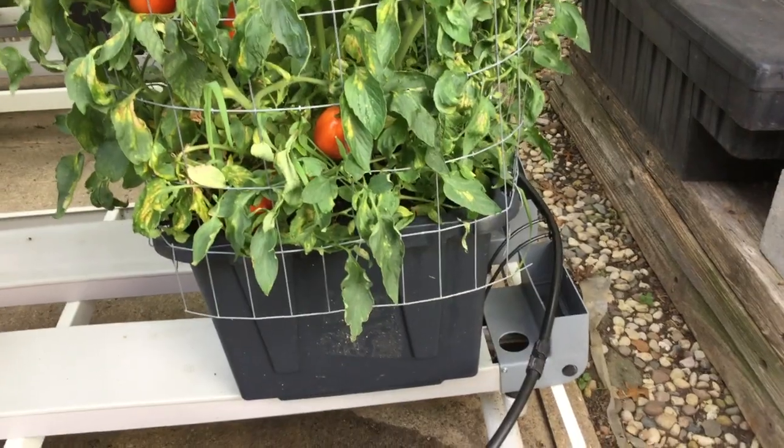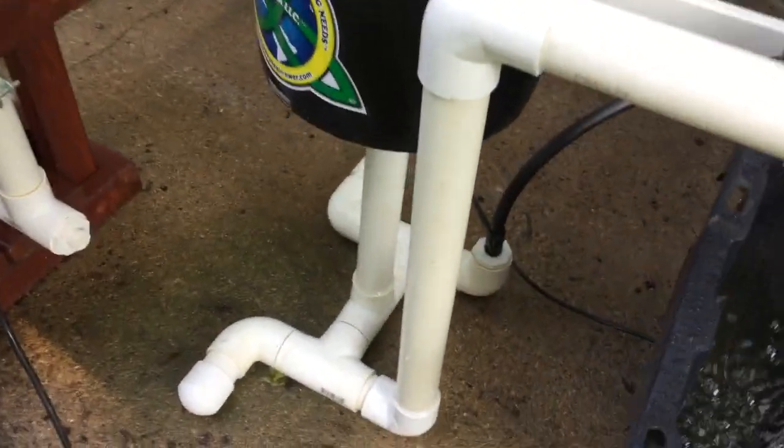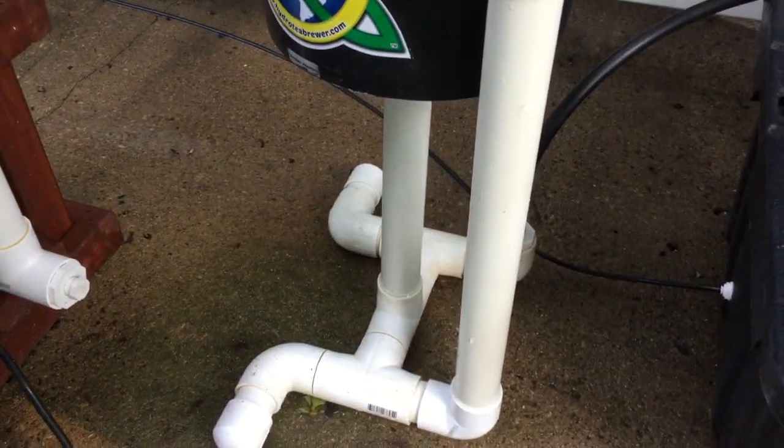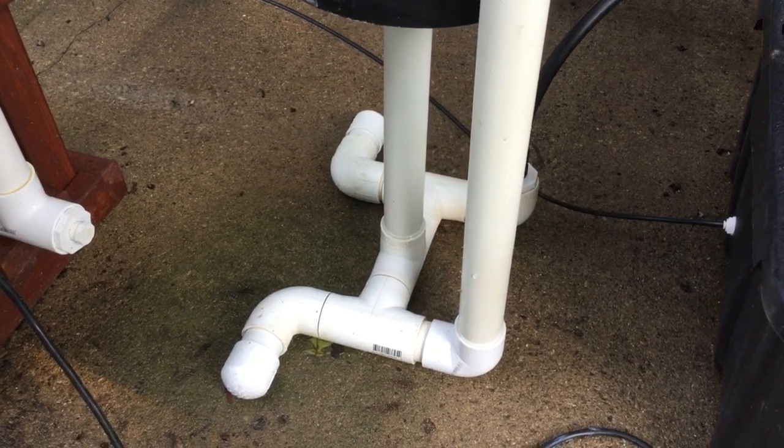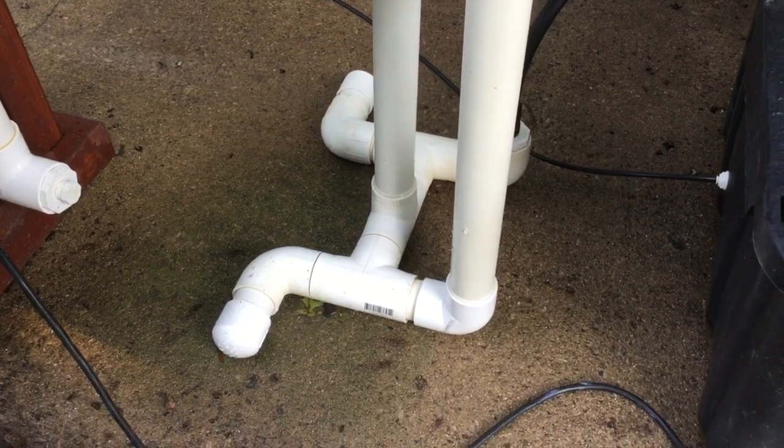So it's structured water going out to my grow system. From there in the grow system it's a closed loop and the water comes back through that two-inch pipe. I don't have any glued fittings on this because it's going to gravity-drain into my reservoir, so it doesn't need to be glued. But anytime you have pressure, you should glue fittings — that's why it's leaking.